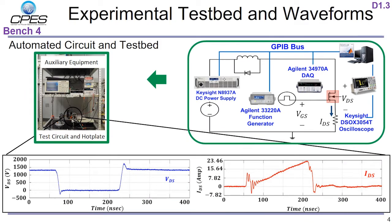These experiments apply a high voltage equal to 90% of the measured breakdown voltage, approximately 1450 volts. The device is then switched on for 150 nanoseconds. The on time is set to stress the device through switching events alone and decrease conduction losses and ultimately minimize self-heating effects.